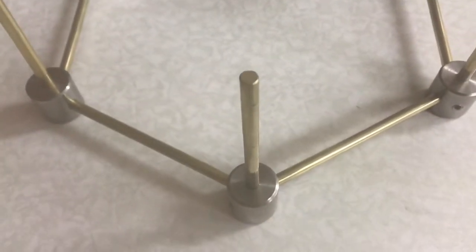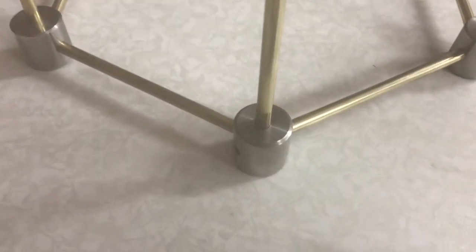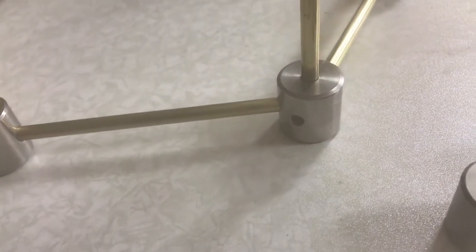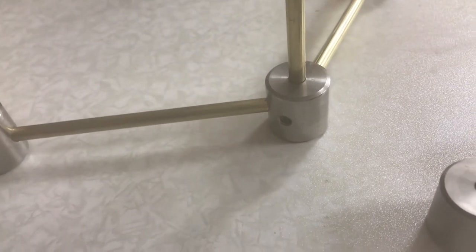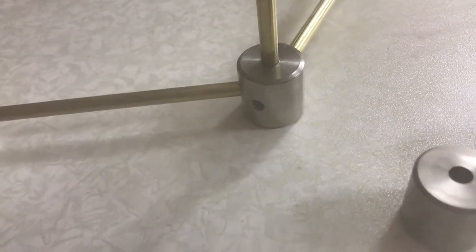What we need to do now is make two more holes at an angle of 120 degrees, which was a little more tricky than I expected. We'll do that with a four jaw chuck. This next part of the project is to mark these two holes on the sides, and then we have to put in holes for grub screws.